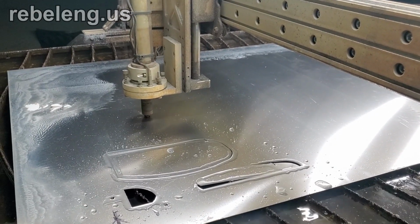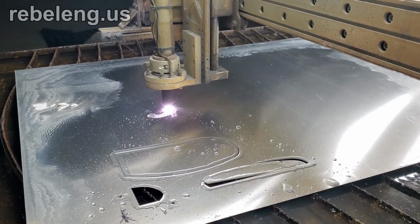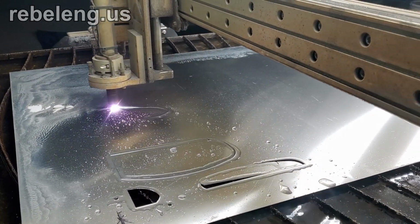The benefit of blowback systems is that there isn't any high-frequency interference. This makes them ideal for DIY CNC plasma tables. The negative is that there's more moving parts and more misfires. In my experience, I've been able to eliminate most of the misfires using a water table. The water seems to keep the torch head cleaner. If I run the system dry, misfires become a real problem.